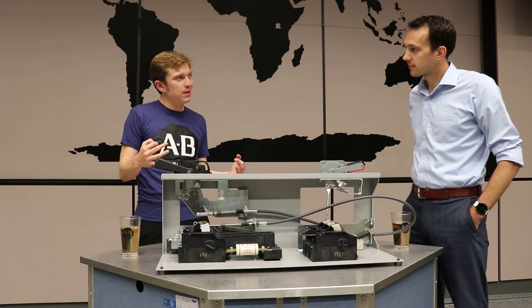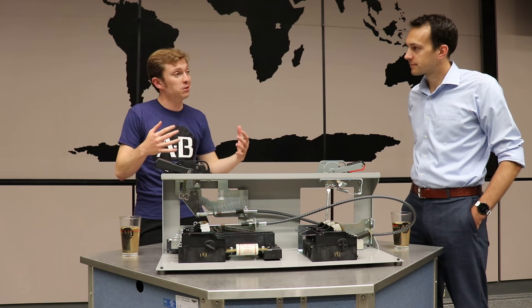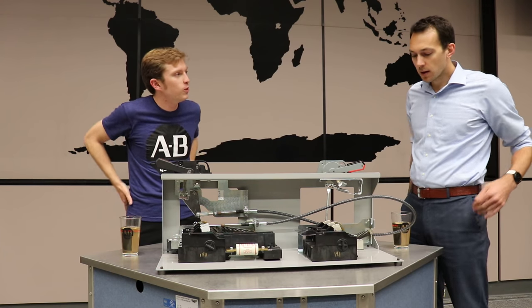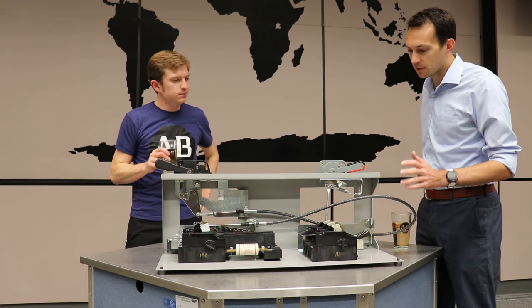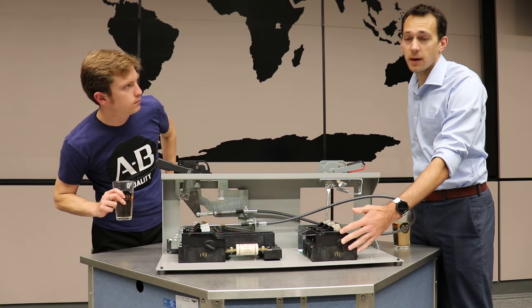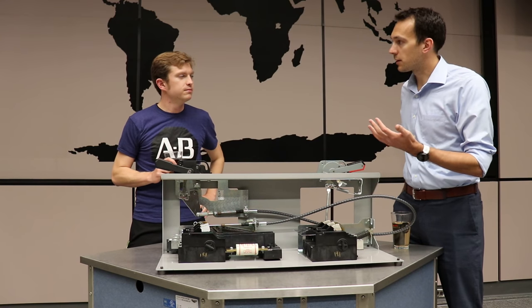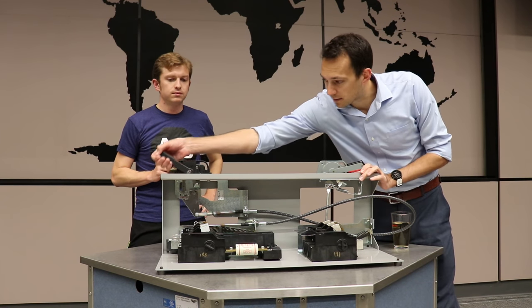In addition to that, high-flexible cables — this has been kind of a characteristic of some of the other components we've looked at recently. Can you go into that a bit more as well? Yeah, certainly. So the nice thing about high-flexible cables is it really gives you the ability to locate your switch wherever you want in your panel. But the other thing too is that it really makes it easy to operate the switch — it reduces the operating force.